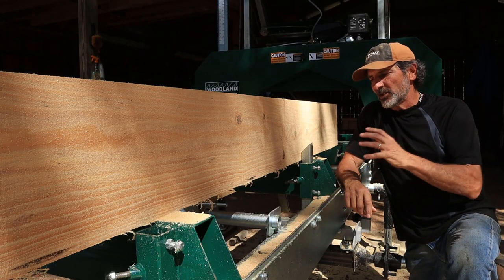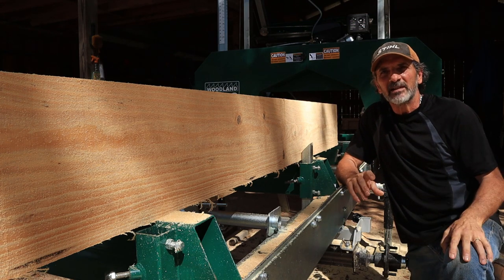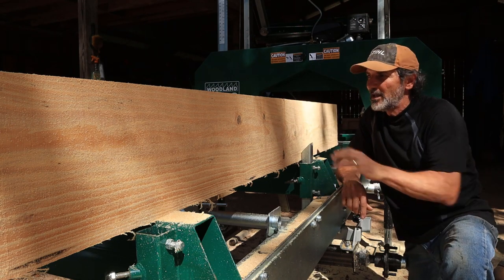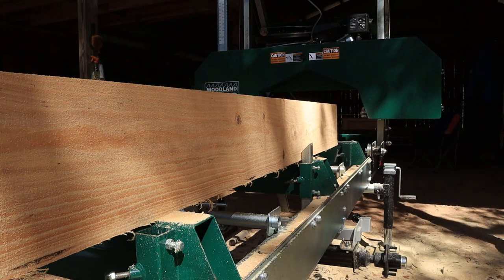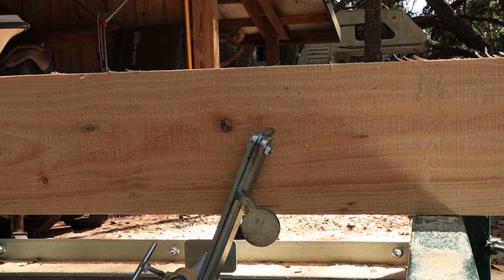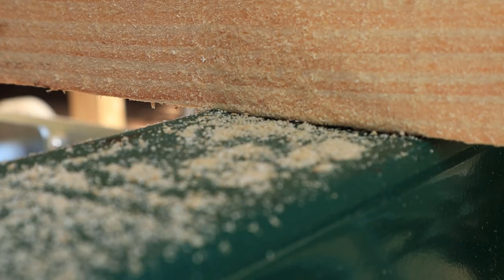The purpose of this video is to show you the mistakes that I made when milling a log into a beam. Sometimes the beam would come out perfectly square and sometimes it wouldn't — I was confused by that, and it took me quite a while to figure it out. Part of the problem stems from the fact that these log stops are positioned low in relation to the height of the beam or the cant. Part of my process for securing the cant to the mill was to take the tough-guy approach and slam the log dog in as hard and sometimes as high as I can.